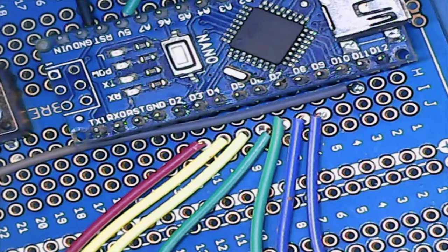It's not really, the board is fine. It's just that when I documented some of this stuff, D9 is empty. I've been doing it as D2 through D8 or something. Somebody said one was off. Yeah, D2 through D8. Apparently on my board, it's D3 through D9, which would explain the weird coding errors I was seeing when I was playing with the soldered board. But that's why we build prototypes.